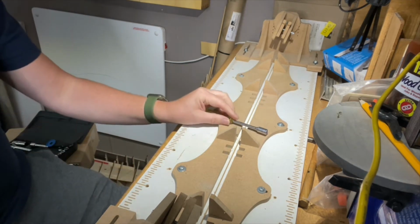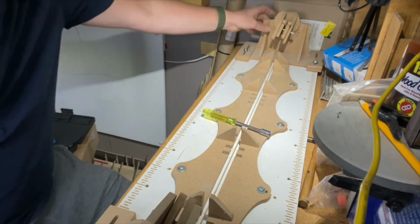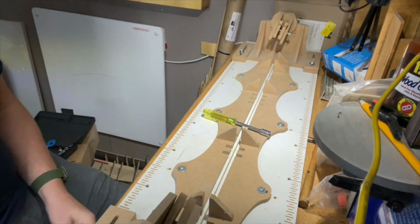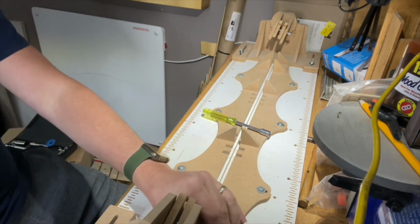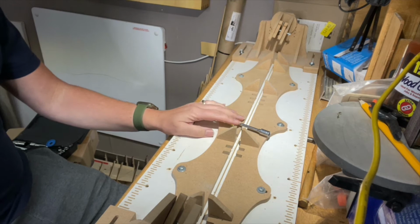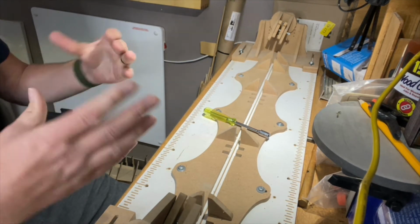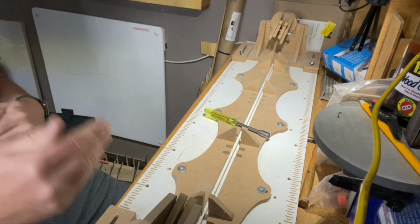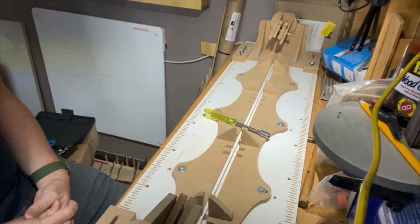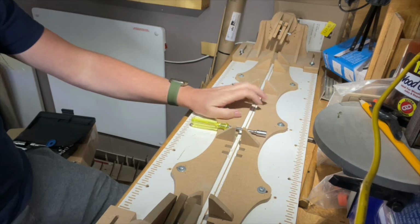So that is the jig, and hopefully you'll be using your jig exactly the same way to get your boat squared up correctly. If the frames are out of alignment, that can be quite a nuisance later on, because obviously it's going to affect your dimensions. If the boat is twisted, when the planks go on, they're going to be twisted and it will have a knock-on effect. So you need to ensure that this part is correct when you're putting your keel in and setting your frames up.